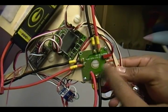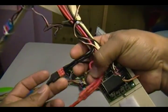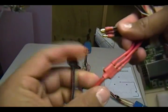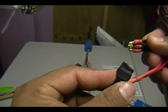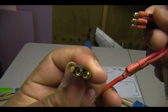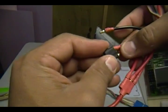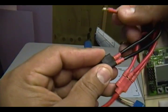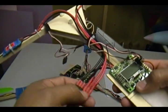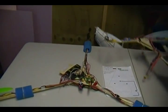If you don't want to buy a board and you have a bunch of bullet connectors laying around, you can do what I did on this T-copter — same concept, just bullet connectors soldered onto a copper plate. That copper plate was actually a copper pipe that me and my friend cut a chunk of and made flat. We soldered the bullets to it, and they need to be a little bit far apart from each other so the bullet heads have room to disconnect, letting you work on a motor without dealing with the big frame.